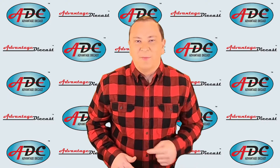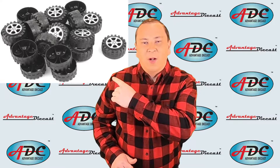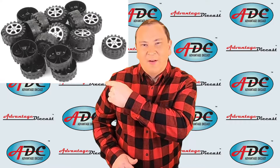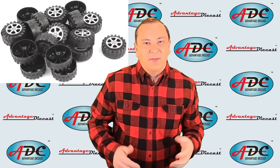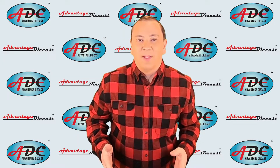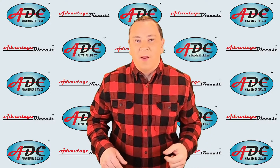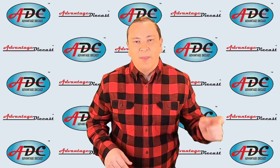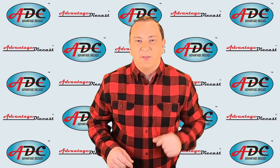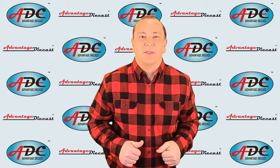Back to the mass produced ones — this is the first type of wheel over here. You can see where the plastic wheel and the tire are made together; you can see in the back where it's kind of hollowed out, showing that it's all one piece. This is a very fast process — they can inject as many wheels and tires as they can fit on the mold cavity, throw them out, send them over to a pad printer where they pad print on exactly the wheel pattern they want, and then send them straight to assembly. Very quick, very fast, very efficient.